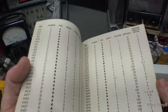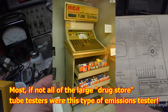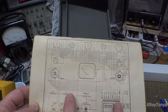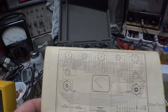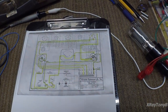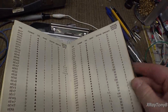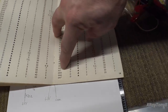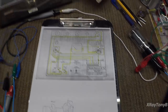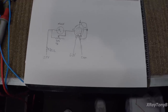It comes with this little manual that tells you how to set it up, and on the back it shows you a schematic. It's very simple — you can see there's nothing to it. The main thing is you have a transformer, a meter, a couple of resistors, and then these switches that connect the different power sources to the correct pins of the tube you're testing. I made a photocopy and traced the settings for a 6L6 tube, and I drew a kind of equivalent diagram of what it's doing to the 6L6.